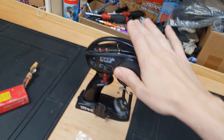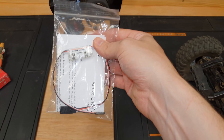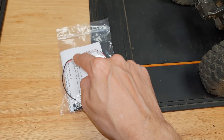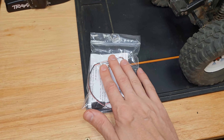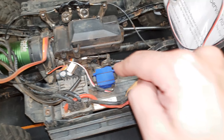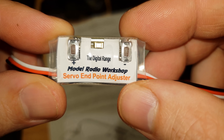If I can't solve the problem then yes I will have to switch to something like that. But what I've got here is a servo endpoint adjuster - you plug it in line with a servo and then you can adjust the end points of the servos. I'm going to plug this in and give it a play. If this works, I'm probably going to buy a couple more and have three on here so I can limit the servo travel on each one.